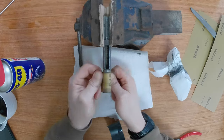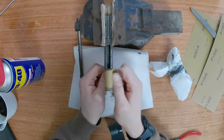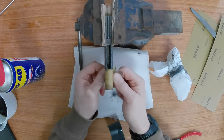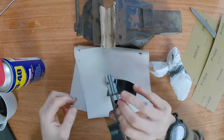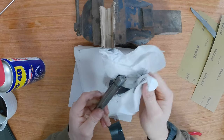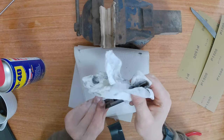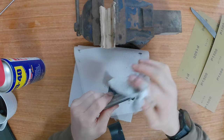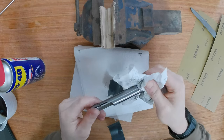You can use this method of sanding for any circular parts — just be careful if they have edges that protrude a little bit more, as it can wear them away depending on how coarse the sandpaper is. As you'll see later on in this video, I use this for pretty much the entire rifle and it does give a very good uniform finish.